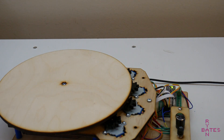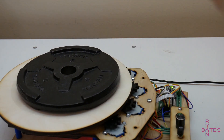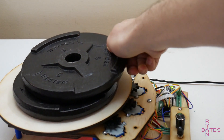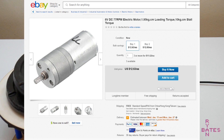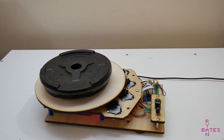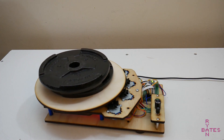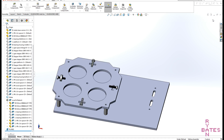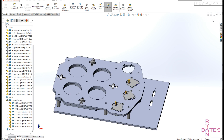Disclaimer: this is a prime example of a simple tool that, if you need it, you should just purchase it. It's another example of why buy it when you can build it for 3 times the cost — but I'm stubborn and I have all these motors I want to use anyway. If you are just starting this project, I really recommend buying a DC motor with an attached gearbox. You can find 77 RPM motors and if you gear it down 10 to 1 you're in the right range for a turntable. Add a PWM driver and you've solved most of your variable speed demands. A servo motor would likely be the next better choice. If you want to build this, I've linked the bill of materials, 2D CAD files, and Arduino code in the description below.